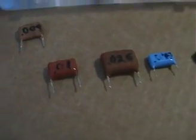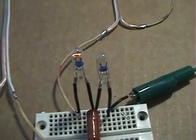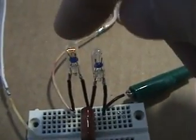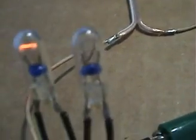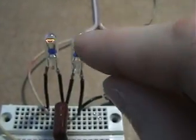So we went from 0.18 microfarads to 0.009 microfarads. Let's take a step up to 0.01 microfarads. We insert that — and now we're getting more light. Tune it so that bulb extinguishes. You can put your probes on with your scope to measure it, or just do it by eye with intensity. Adjust so this one just starts glowing a little bit.